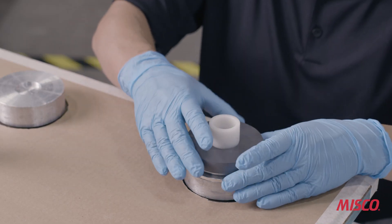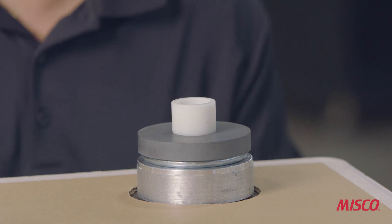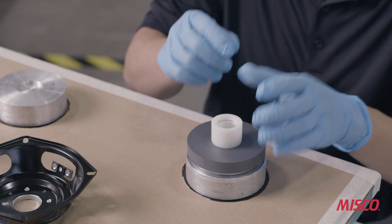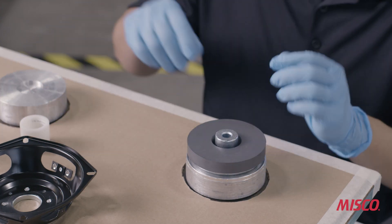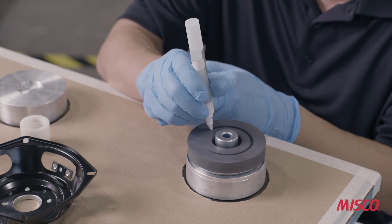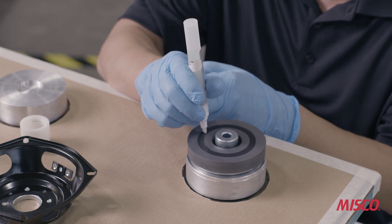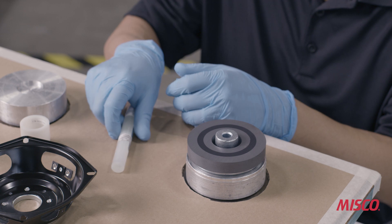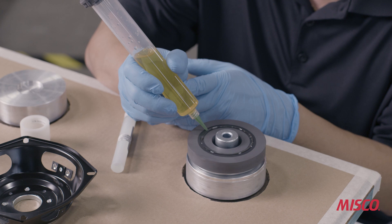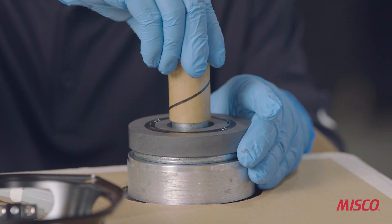The magnet is set in place and a centering fixture that centers the magnet and the T-pole is attached. Next, we remove the magnet to yoke centering bushing and apply the same adhesive to the magnet and basket top plate assembly. We use the primer to accelerate the process and we use the structural acrylic on top of that. This adhesive sets up and cures in about 30 seconds.